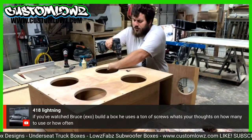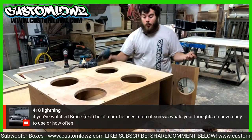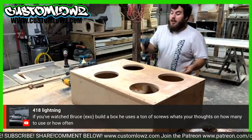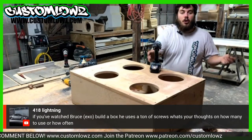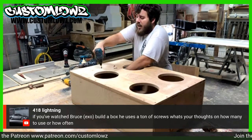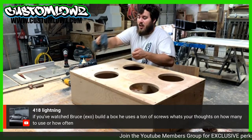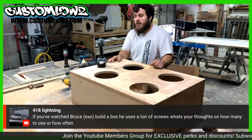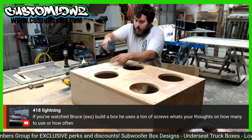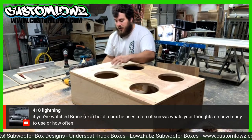In cases of small builds like this, I am putting them on the baffle just because I can hide them. And when I can add overkill, I'm always going to. But in a lot of circumstances, I would just build this box purely using wood glue and brad nails to hold it together. Wood glue is going to be a very, very strong connection, a good bond between your two pieces of wood. It's literally designed and made to bond two pieces of wood together.